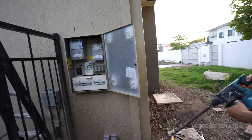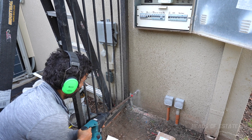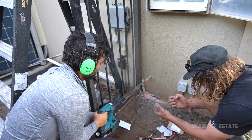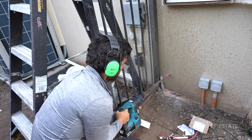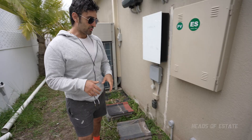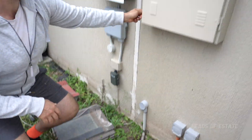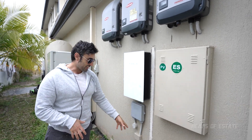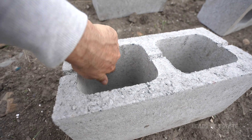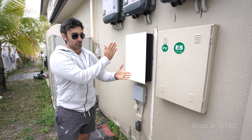There's heritage tiling on the other side — it just can't be touched, it's heritage listed. From the outside we punched a hole through, put a little cap on it, and tried fishing the cable up. With this wall we had a sort of a block, so we had to punch through both sides of the block — through here and this side here — and then there was a little bit of wood to punch through before we could go up.